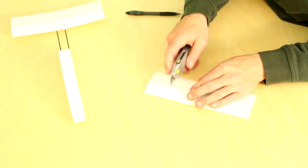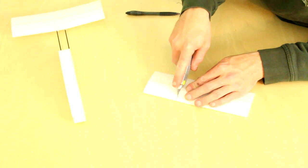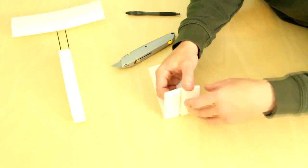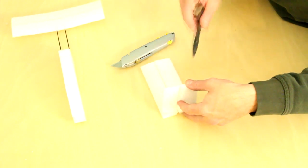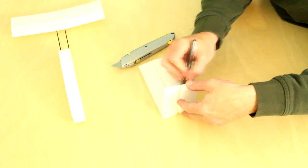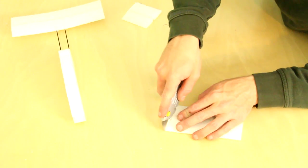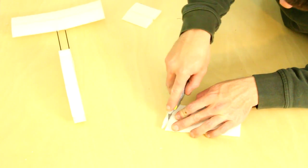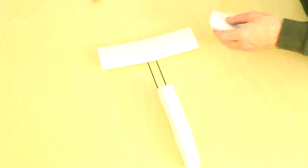The airplane vertical stabilizer is made from the other movable part, cut down to 6 inches. First, remove 3 inches off of the end, leaving you with a 3-inch and a 6-inch section. Then, overlay the cut-off section over top to make the contour by which you will glue this down to your tail assembly. You'll want to cut the back part at approximately a 45-degree angle to make room for the rudder to move when the elevator comes up.